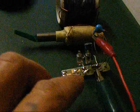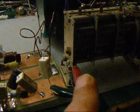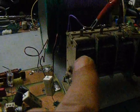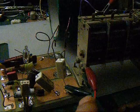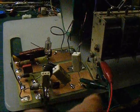We've got the ground wire here which is the green one, and I've got this tanked coil in series with the ground wire. A red wire goes across to the negative of the high voltage tank, which is also the negative of the low voltage tank. Those two points are normally grounded, but what I've also done is connected an antenna which goes up to that plate up there, so that's a capacitance.